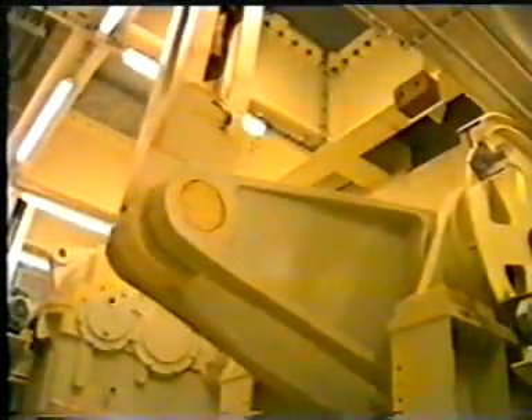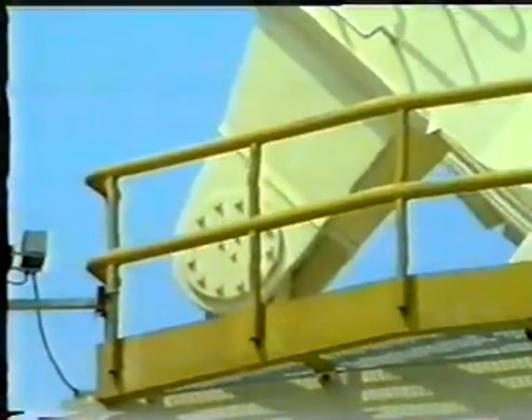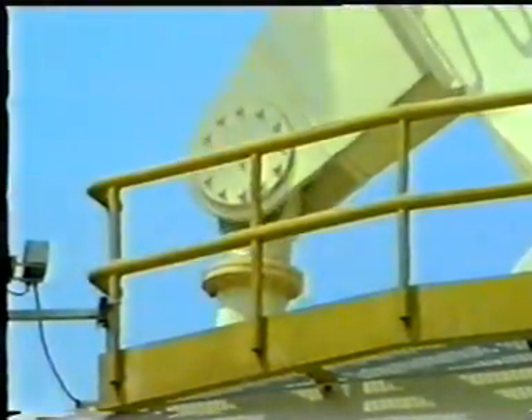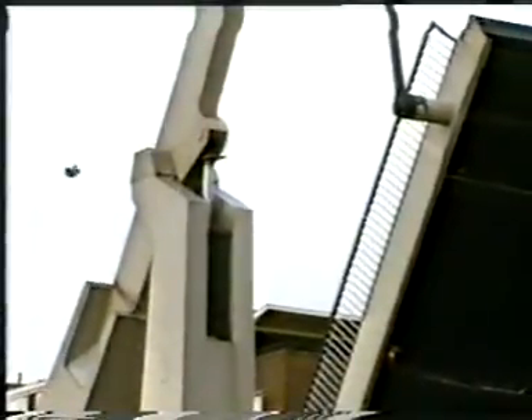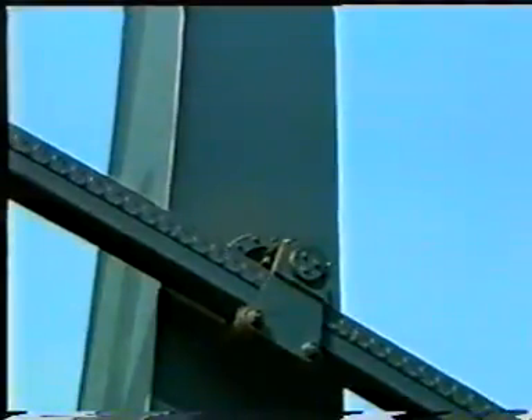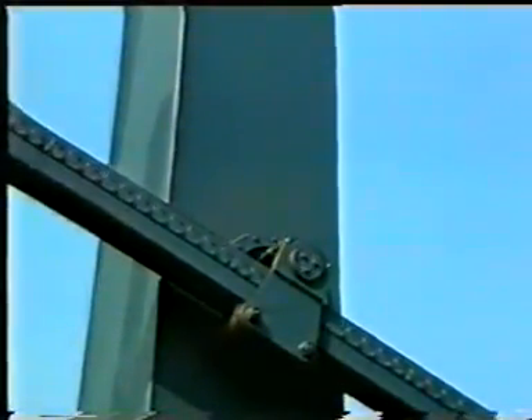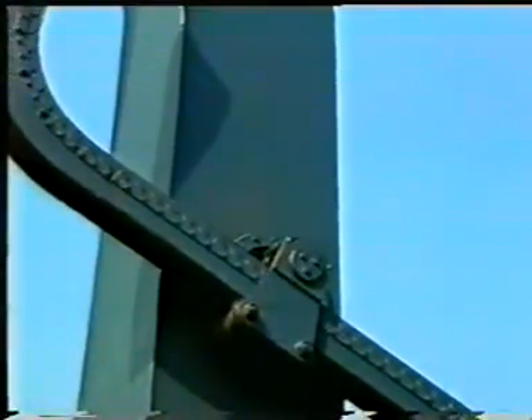This layer usually consists of a slurry covered with a layer of calcined bauxite, with a total thickness of about eight millimetres. Operation of the bridge is possible by means of a crank connecting rod mechanism, a hydraulic system, or by means of a rack — a steel bar passing through or along the side of the column, provided with teeth or pins and meshed with a pinion. The mesh is maintained by a guide frame.